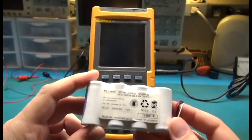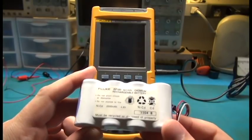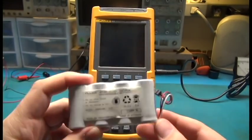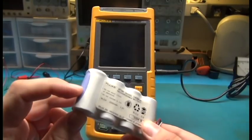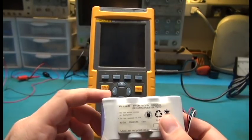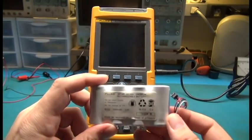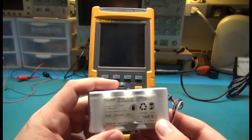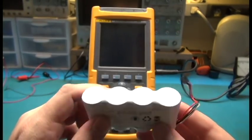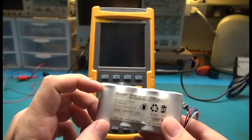My alternative was to see if I could find one on Amazon or eBay, but the clones had some pretty bad reviews, so I didn't go for that. I figured why not rebuild my own pack. I've done some reading on this — you can upgrade from NiCADs to nickel metal hydrides, or even lithium-ion, but the problem is the battery charger and firmware. I'm just going to stick with NiCAD because they're cheap. You can get 10 of them on Amazon for about $10 to $15, compared to the $120 Fluke wants, and I don't have to worry about the charging circuit when doing a direct NiCAD-to-NiCAD replacement.